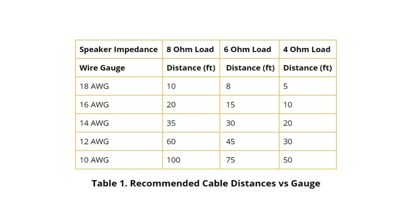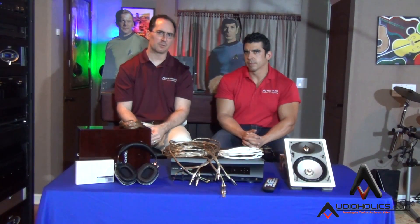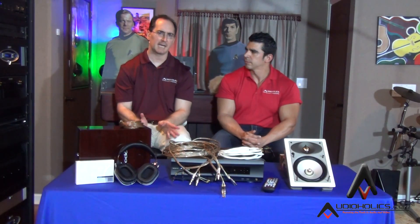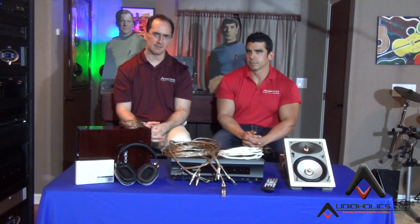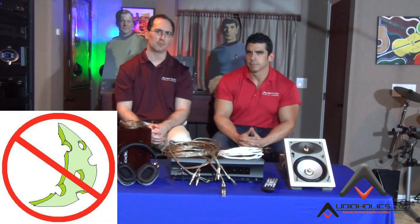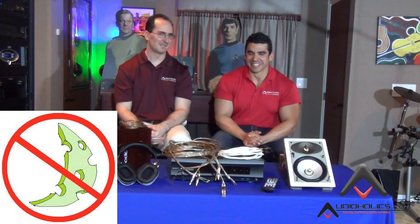For surrounds, you definitely want to go with a lower gauge because you've got longer runs of cable. I have a separate surround system in a different bedroom with cable runs of 60 feet — I ran 10 gauge through the wall to cut the resistance down. Also think about this: if you have a 4-ohm speaker, you need a cable that's half the resistance compared to an 8-ohm speaker. At the end of the day, it's nice to have low inductance and pretty cables, but look at the resistance. If you're not getting at least the resistance of a 12 or 10-gauge cable, don't waste your money on exotic cables. A lot of these exotic cables promise you the moon and give you cheese.